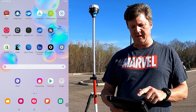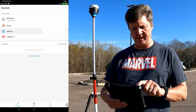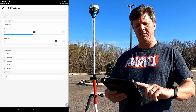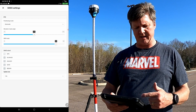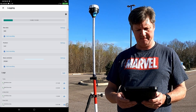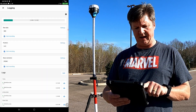The next thing we're going to do is connect to our rover. I'm connected to Wi-Fi, let's open up ReachView 3. The rover is available — I click on that and check settings. Looking at our GNSS settings for the rover, you see it's set to kinematic where the base was in static, all other satellites are selected, at 1 hertz. Going into logging, we're using the UBX default settings. I'm going to hit cancel and I am ready to start recording.